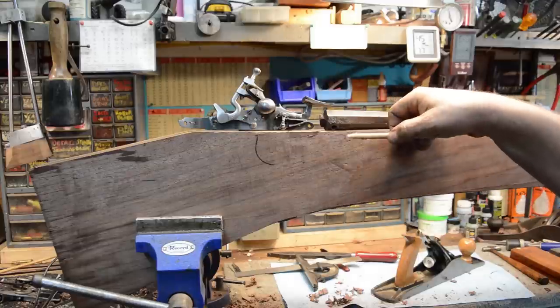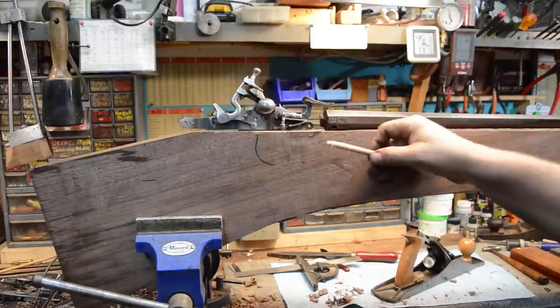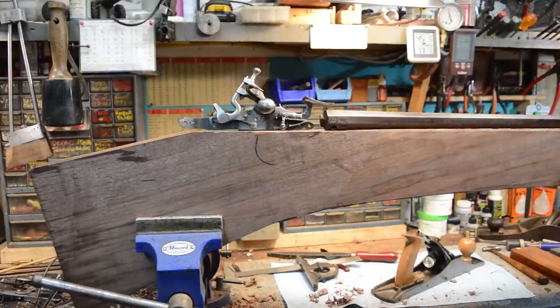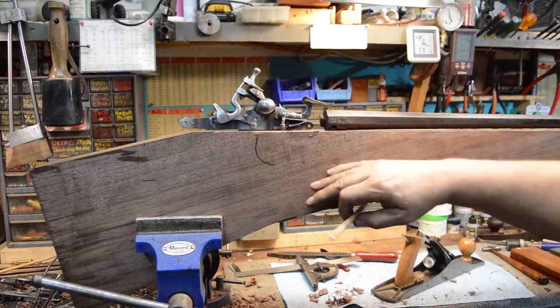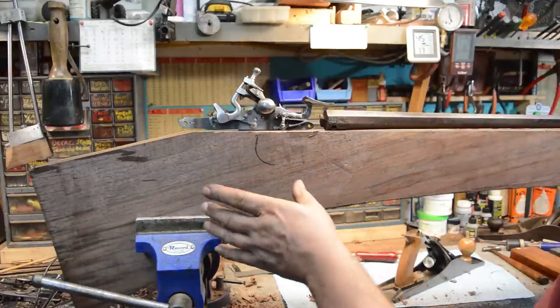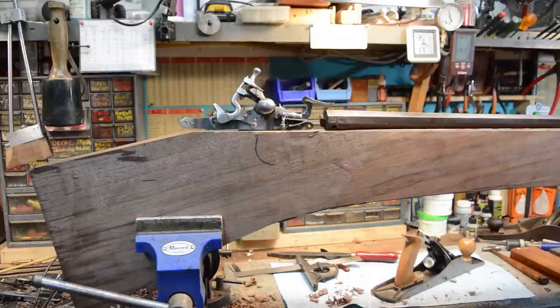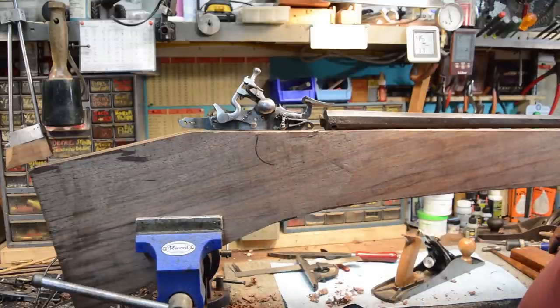So we've got a nice sharp edge here now, the top is absolutely perpendicular to the side. So we have the profile and the plan set at 90 degrees to each other, so we can flip this thing over. And we will work the rest of this project in plan and profile until the last possible moment when we take this thing off squares. And that's a different thing for another day.